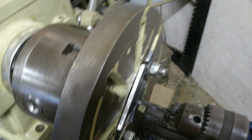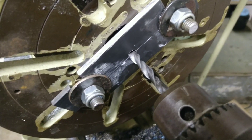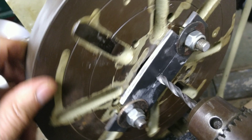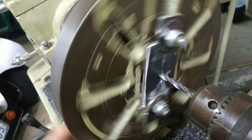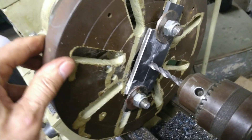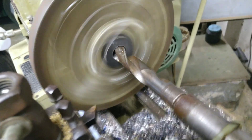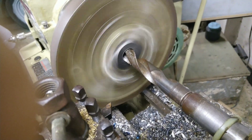What I've done is I've got a piece of steel here. This is in my faceplate — I'm a bit lazy to put a four-jaw chuck in, so I'm just going to bore it out using the faceplate, which is a lot easier. I've gone through with the 25mm drill and now I can bore it out to the right size.